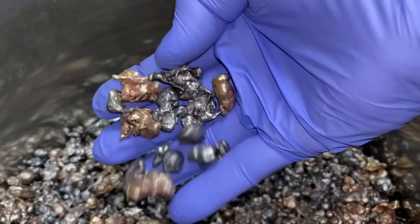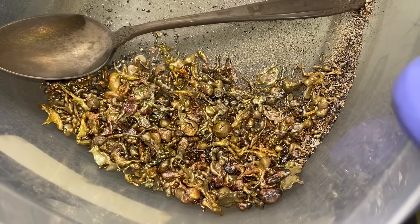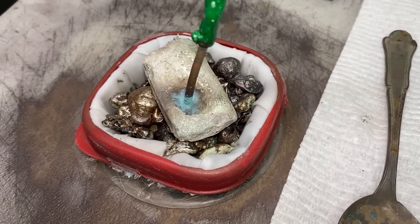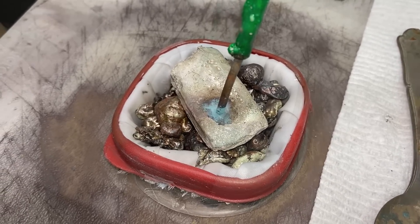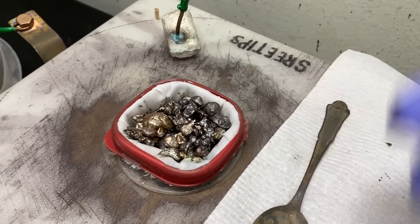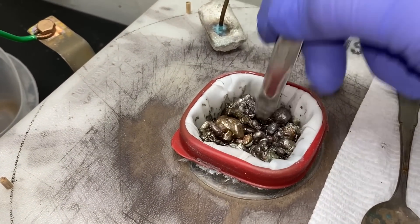Those bigger pieces don't digest well. Here's some smaller ones — that's the size that I really need to be feeding into the anode basket. What happens is the pieces get stuck on the inside of that Dacron bag and get held up, suspended in the air, not making good contact with the electrolyte. So I have to keep a close eye on this. What we're going to do is pull the anode bar and use a metal spoon to knock these crystals, or the impure silver, down into the anode filter a little better.